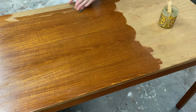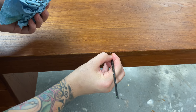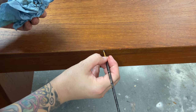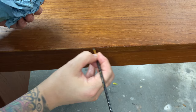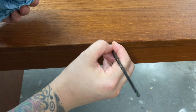I haven't oiled the front lip yet but even so you can see there is still some discoloration on the top, so I'm going in with some gel stain and just trying to touch up that color a little bit. It's not going to be perfect but I'm just trying to help it blend in. This area was extremely chewed up in the beginning and there was some missing veneer there anyway, and with the filler on top, this little bit of gel stain will just help camouflage that a little bit.